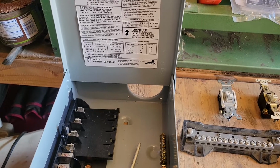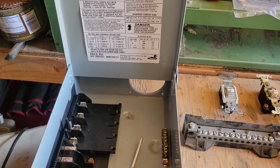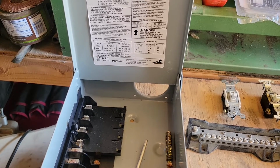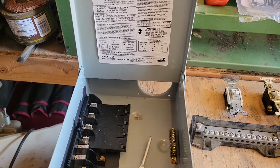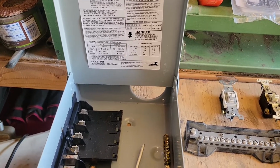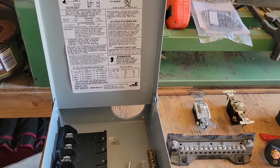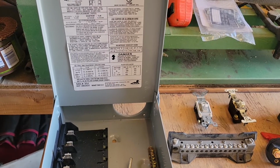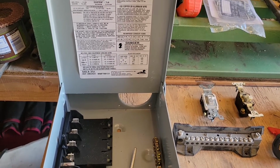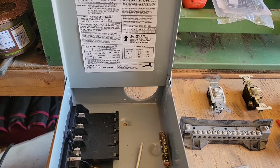Well, rule of thumb, if you're using 14 gauge wire to power something, that would normally be lights in a household. Okay, so for all of your lights in the household, they can get away with 14 gauge. Now, in commercial and industrial, that has to be all 12 gauge. You can't go down to 14 gauge. And I say down, and you say, wait a minute, 14 is a bigger number than 12. Well, in wire sizes, the bigger the number, the smaller the wire. So 22 gauge wire is smaller than 14 gauge wire. All right? Little confusing, but not that hard to understand.